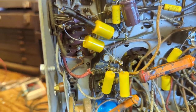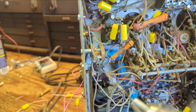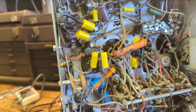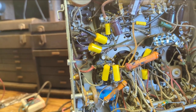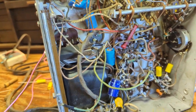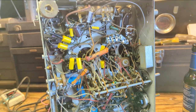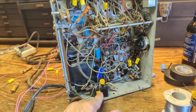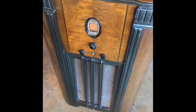What I do with these bakelite blocks is get a little drill bit and you see these guys have little rivets — if you get the right drill bit you can drill right through the rivets and it disconnects everything inside. Some people prefer to stuff the old components back in, which requires unbolting, heating the tar, and digging it out. I choose to do it on the outside. I don't want to get too far ahead of myself — sometimes I wire bakelite blocks wrong. Since the first one worked fine, I'm going to test the set again to make sure we're still firing on all cylinders. It's working even better.